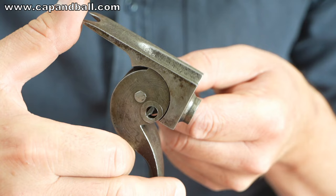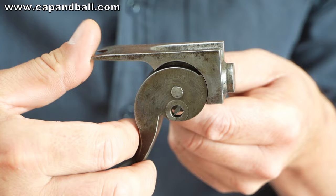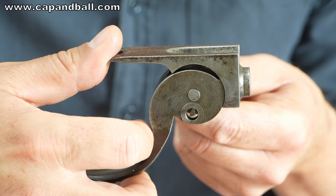The cylindrical front of the breech block pushes the cartridge into the chamber, while it also locks the action and somewhat seals the gases. This breech block is moved by the eccentric cylindrical part of the operating lever. This is actually a simple and strong mechanism.